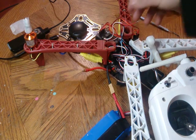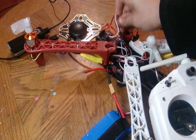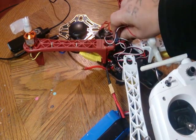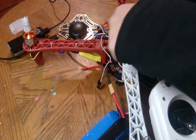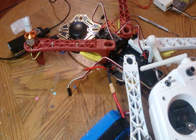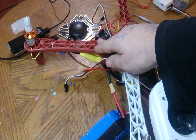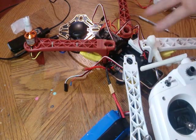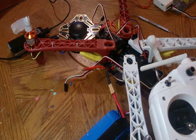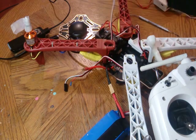Now what you're going to want to do is continue leaving the power wire off and unplug all the wires — all the outputs for the motors. Don't try doing them all at once, because what will end up happening is once it goes to the menu, this ESC might be on three beeps and this one might be on two beeps. When you try to do a setting with all of them at once, they'll be all out of sync and you'll really screw up all the ESCs. It's a process — you'll have to work with one at a time.